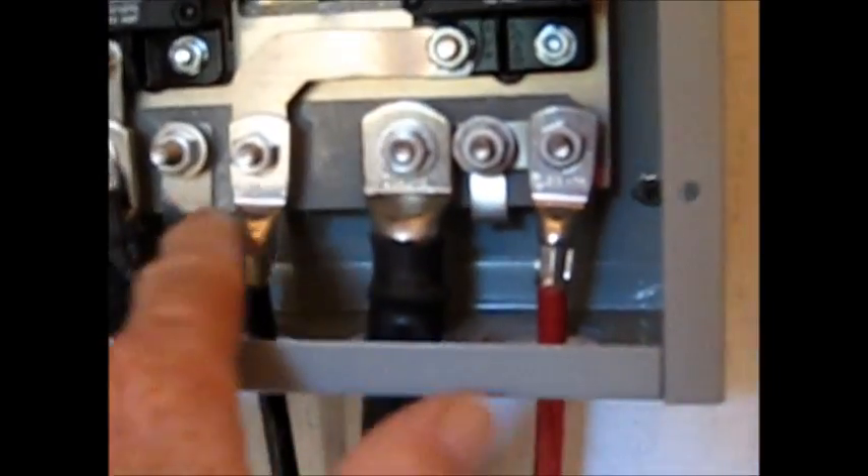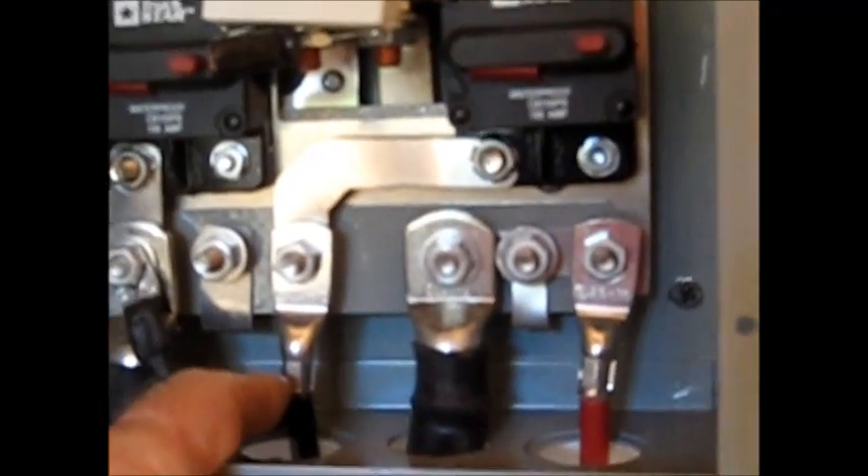I used a screwdriver and a ratchet and torqued them on there really good so they're not moving at all. Got this all wired up with three strands coming in from this one here and then the other one hooked up over here. Looking down on the bottom, the positive from this one comes over and goes into the positive of the other one, then comes out and goes to the Missouri Wind and Solar charge controller. Same thing from the negative — I'm using number four wire and that's coming up to the charge controller. Got some lugs put on here, crimped like they say to do in the book.